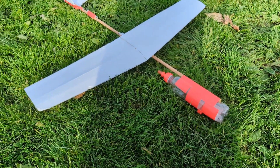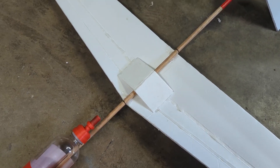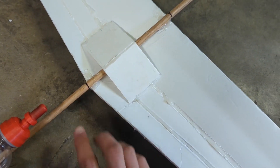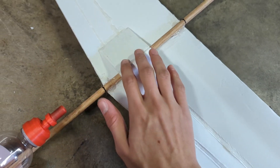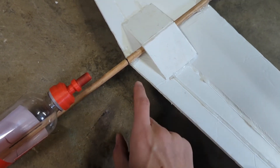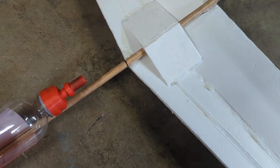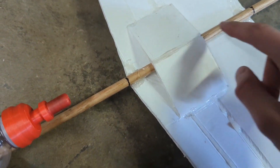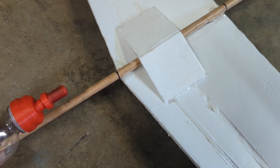I'm not really sure how that'll work, because it didn't really get off the ground. I've now repaired the wing. I glued it back onto the main fuselage wooden piece, and I added this foam strut in the middle that holds it on there a lot more rigidly than it did before. When I flew it before, it was just glued on at the front and back at these small contact points — it was really weak. Now there's glue running along the top and down both of these sides, which is a lot stronger.